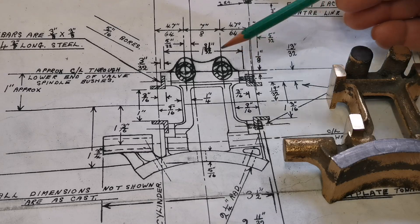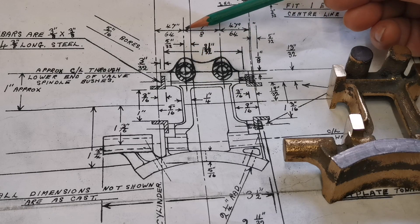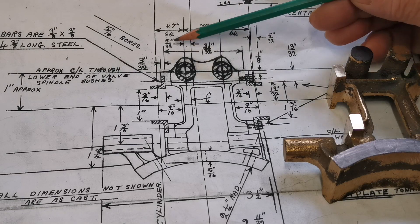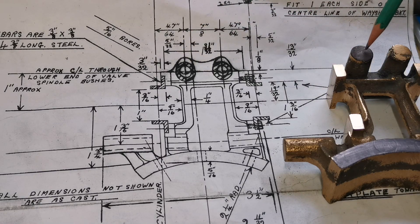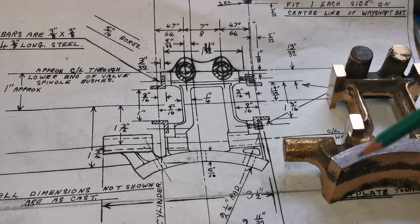The center of the boiler — if you look, there's the center of the boiler line. From the center of that hole there to the center of the boiler is five thirty-twos. So I'll get the center of that on the milling machine, come out this way five thirty-twos, come down here two and three-quarter inches — that will be the boiler center. So the center of the boring head will be two and a quarter inches to the center there, cutting on that diameter. So let's get this marked out and set up on the milling machine.